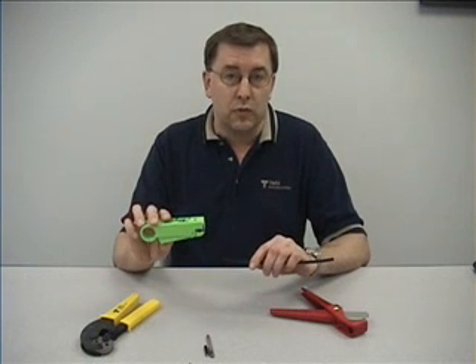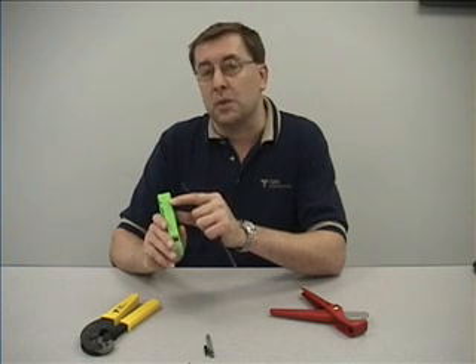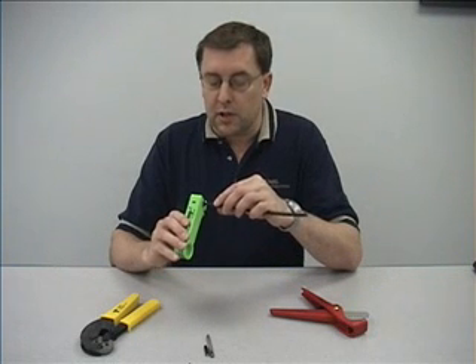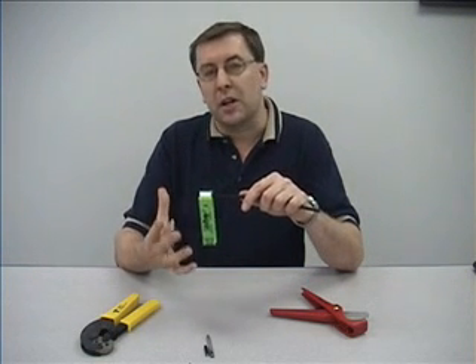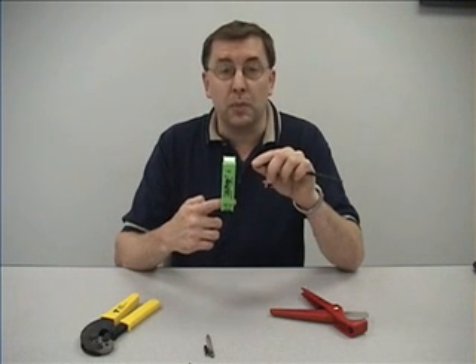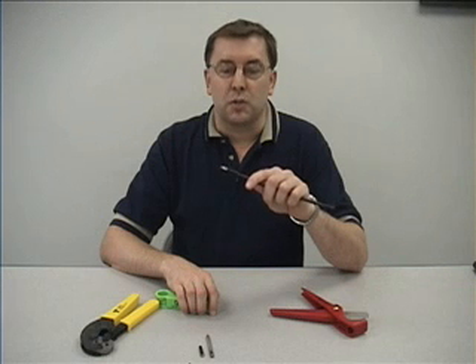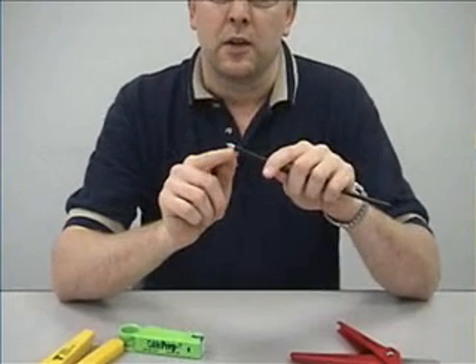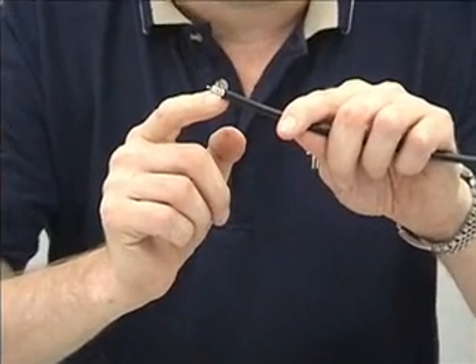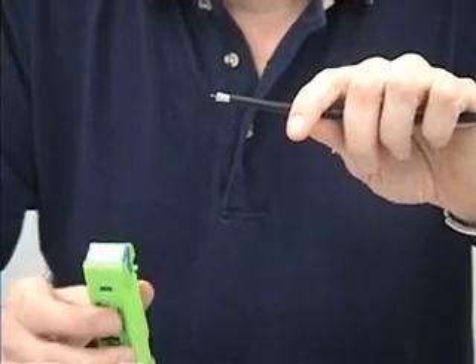Next, we'll take the ST-240 stripping tool — it's a one-step process. There's an arrow on the tool showing the direction the cable should be placed. Place the cable into the cable slot and slide it in until it stops. Release the spring and let it clamp down on the cable. Place your finger into the loop at the end of the handle and spin the handle four, five, or six times around the cable, then remove the material. You now have exposed center conductor and exposed braid, stripped back exactly the right amount. This tool lets you remove the jacket without nicking the braid, which is very important for tensile pull strength.